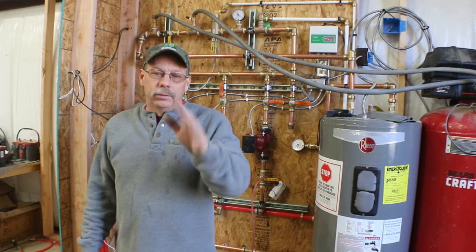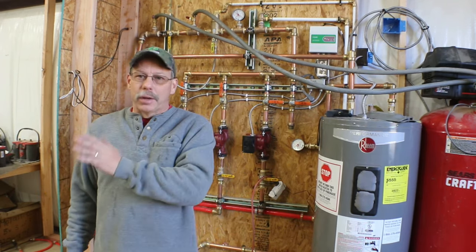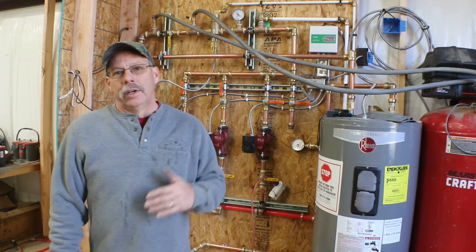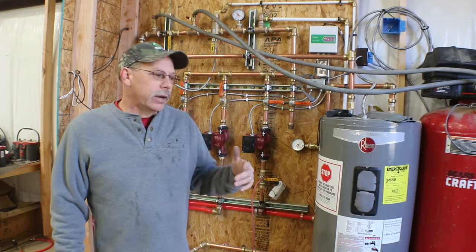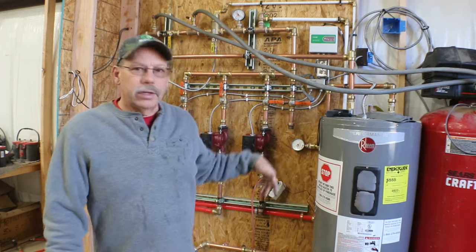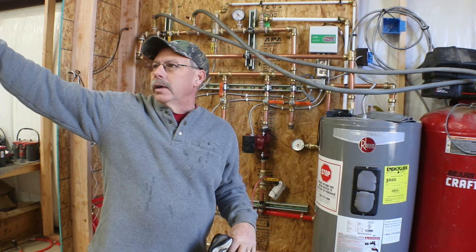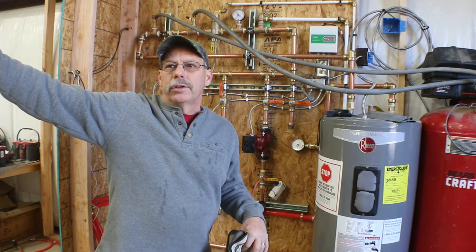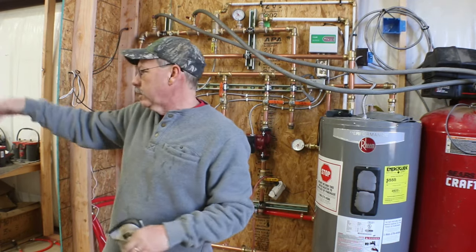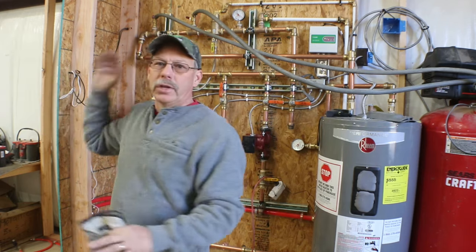So learn from my error: slow down a little bit when you start laying stuff out and think about, hey, 300 feet max for half inch PEX. And my plumber said you can stretch it a little bit here and there, like loop one that we were doing. It does just the perimeter on this end of the building. So it had to go up around, maybe 120, 130 feet, and then it comes back, and then it loops down this little sidewalk thing I have here in the middle that ties the main post together.